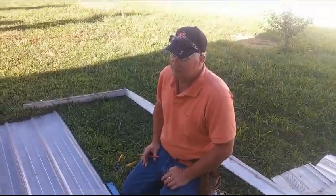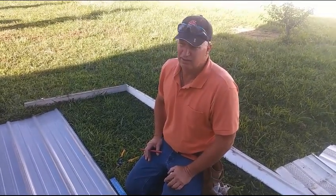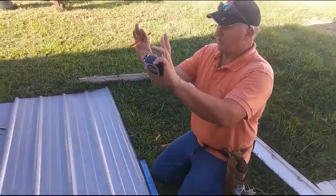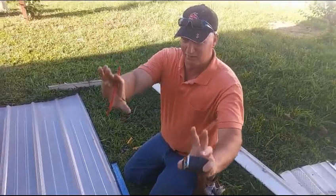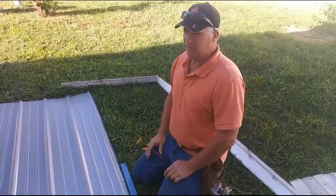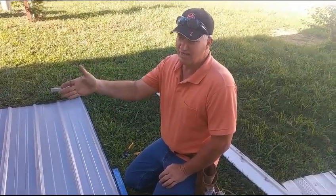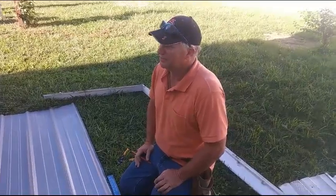The reason that we leveled it was mentioned to me that I should explain. There's another video, it's like an hour and a half long. It goes through every little detail. But the reason we level that is if you don't have it level, every time it'll end up staggering, and your corners won't line up. Nothing will be easy to measure to, and it won't look aesthetically right.